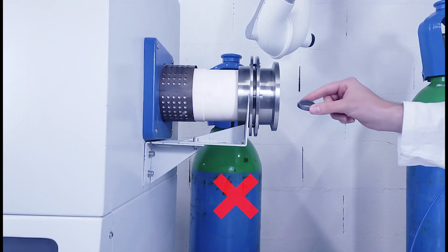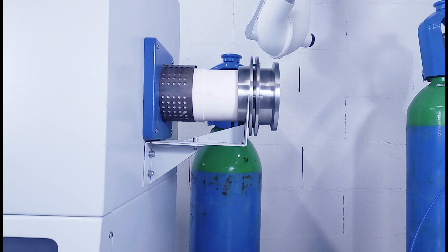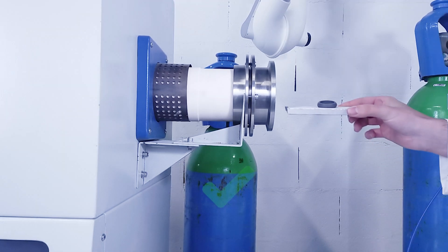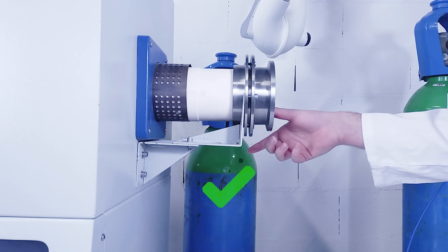All the data about the sintering temperatures and shrinkage rates are available in our filament guidelines. First, you have to place the part in the furnace tube. Do not place a part directly in the tube — you need to use a crucible. Place your part in a crucible and then push it in with a metal rod.